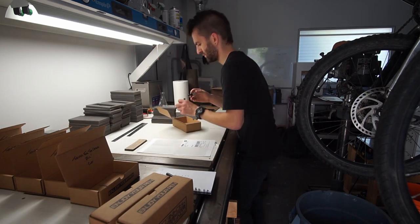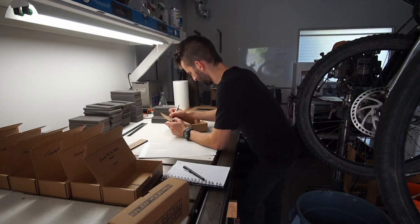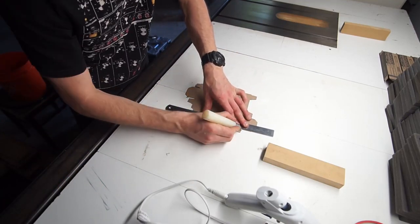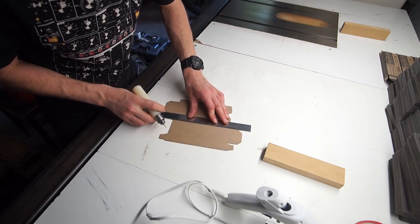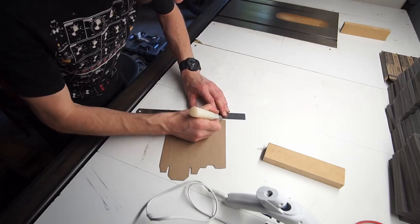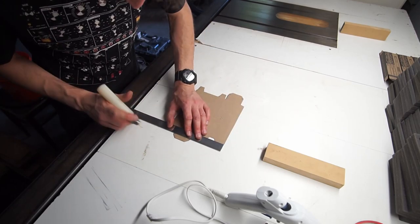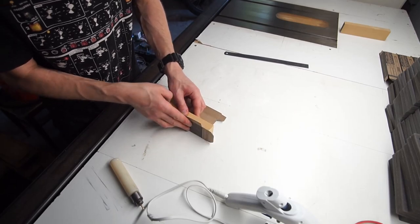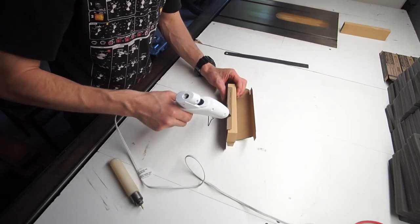Essentially what I did is I just sheared the paper, the raw pieces, to size by printing lines on them. Nice, easy cuts to make, straight cuts. And then I could put that in the laser aligned to a stop in the machine, and then I could just keep running boxes like that. So they're not perfect yet. There's a little bit of variance between my laser and the printer, depending if the printer didn't pull it through perfectly smooth or whatnot, but it's close enough for my process to work, because it takes like 7 or 8 minutes to hand cut them and like 20 seconds to laser cut them. So yeah, that's the way I'm going through with it.